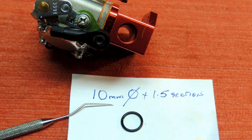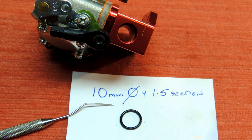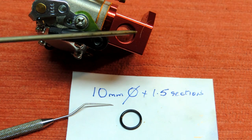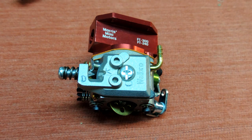Here's the Morris manifold as supplied, and the O-ring which you can see is 10mm diameter - that's always the inside measurement - and the section is 1.5mm. Freely available metric O-ring, but if you're careful you can prise the O-rings out of your engine in the existing manifold. As you see there, I've got a dental pick - probably won't get one of those but something similar. That little beastie there is what the dentist jams in your teeth, very good for getting O-rings out. That comes out and obviously it fits in here in the manifold. A little bit of Vaseline in the groove, O-rings both sides - must be done otherwise you're never going to tune the engine.